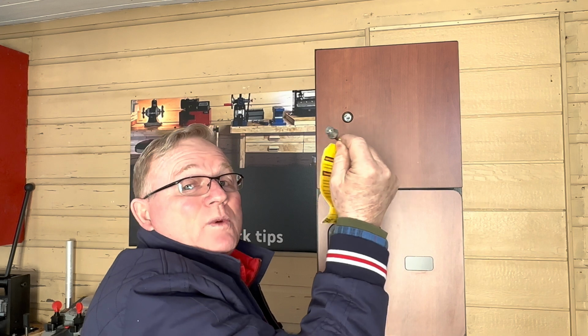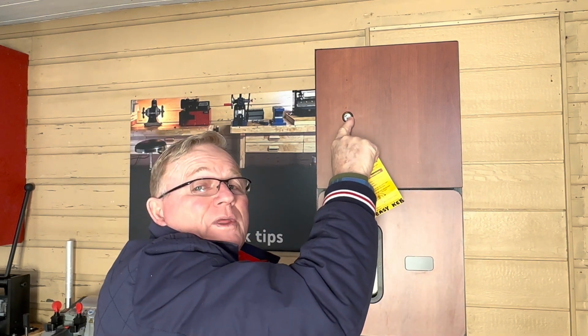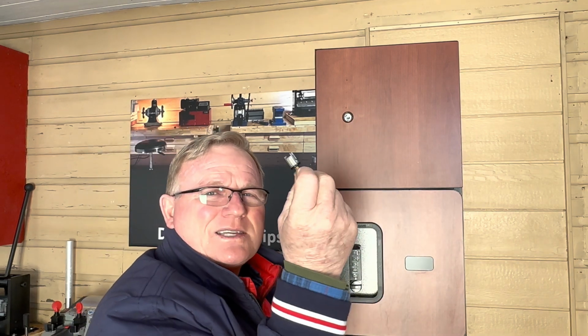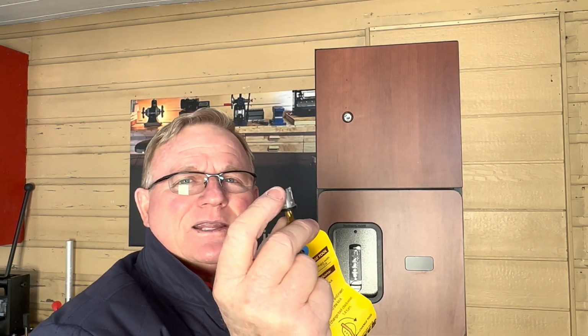So we're going to just remove the core. We're going to take off this nice little beauty ring. We're going to pull that off, and we're going to replace it with an electronic lock. We're not going to pull off the inside of the lock. All we're going to do is get rid of the core. No more nuisance keys. You know, who wants keys? So we're just going to put an electronic lock that has a cam that slips into the inside of this lock, just like this beautiful little core does. So let's see how it's done.